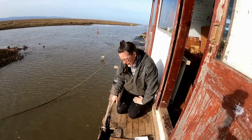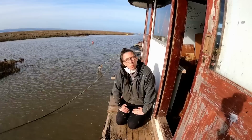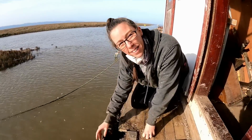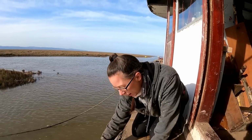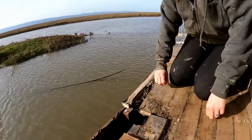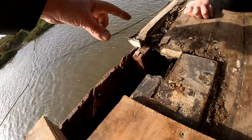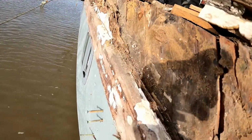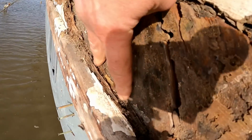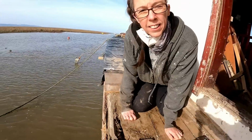So last night you were working outside, we had a lot of people going, oh, I thought your hull was double diagonal and you only got one skin. So the reason that there's only one skin here is because the outer one stops further down. They've cut it back and they've done that for when the bulwarks went on. So yeah, it is double diagonal, but one's higher, one's lower. If you look at the angle of the planks there, that one goes up that way and then the outer ones go there. But then the outer ones, you see the outer ones are here, so very hard to film, but then they basically cut them off. You can see the remnants of the plywood, as Gemma was saying.